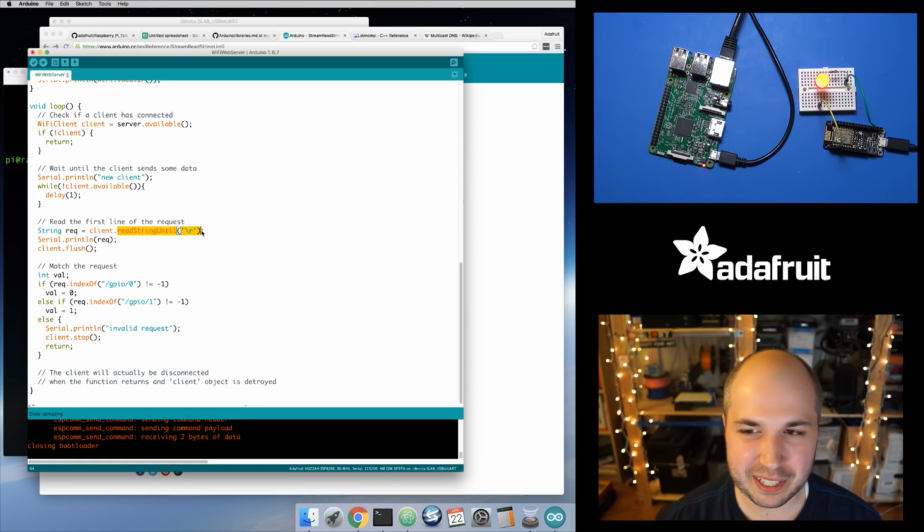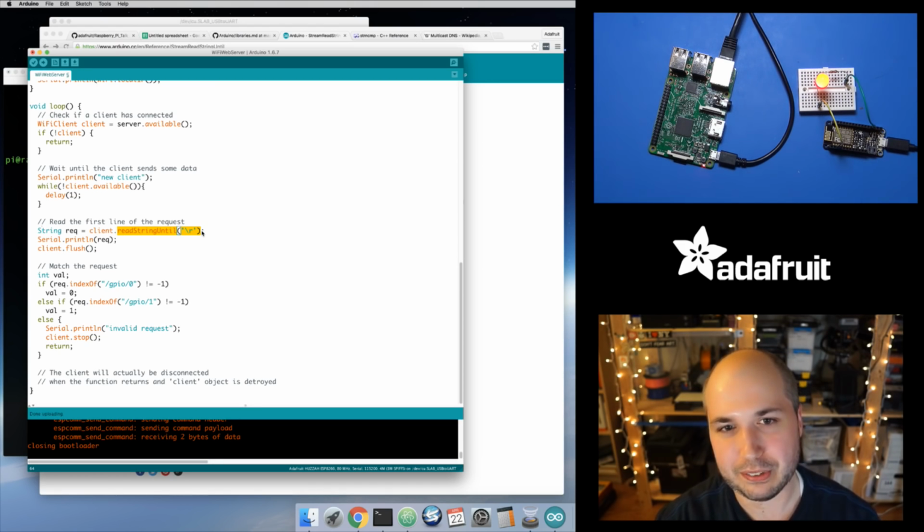If you're lucky, you get an error back and you catch that error and you can handle it, and maybe you can get rid of some unused memory that you were using before, and maybe you can allocate more memory. If you're unlucky, maybe the whole chip just resets itself because it doesn't even handle that kind of case. So you get all kinds of funky situations like that. Now, it's even worse on the normal Arduino boards like the Uno, because they only have 2 kilobytes of memory. And so it's very easy to go through that memory.